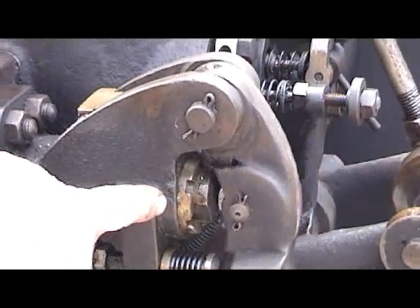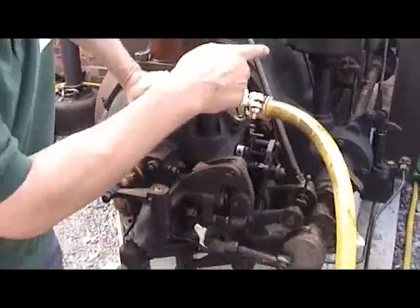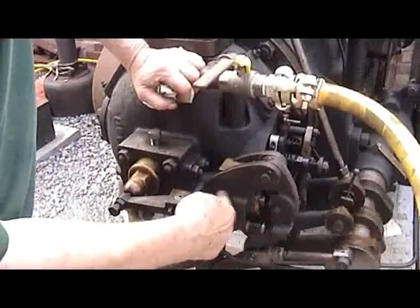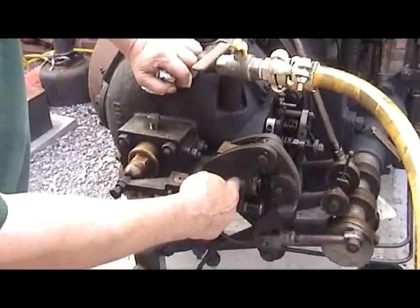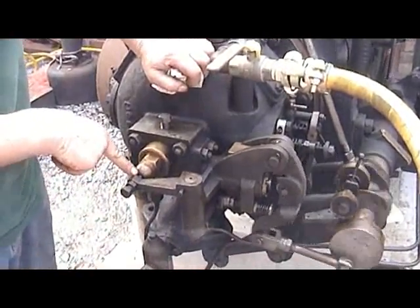There — now it'll fire. This is a spring injection, so the chamber in there is filled with fuel from the fuel pump. That preloads the fuel through a spring plunger, so it's always at constant pressure from the plunger on the spring in there. And that's the release that actually lifts the injection nozzle.